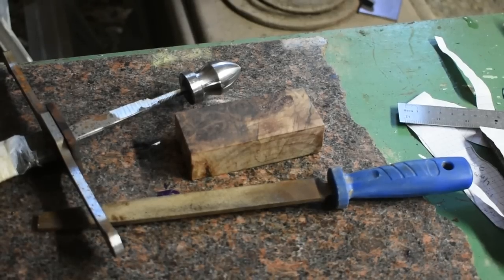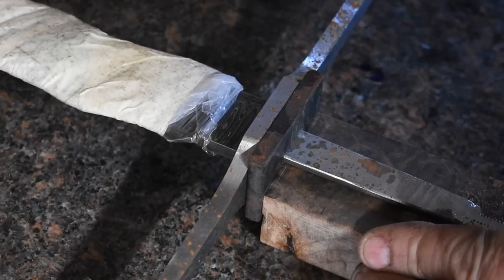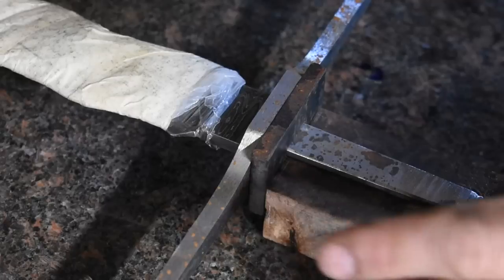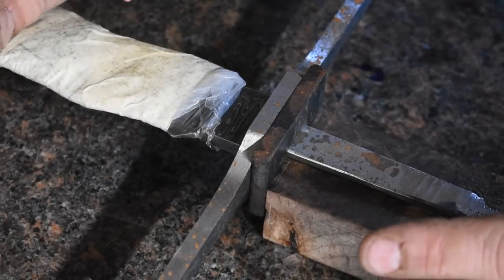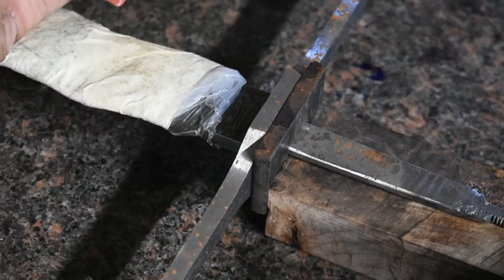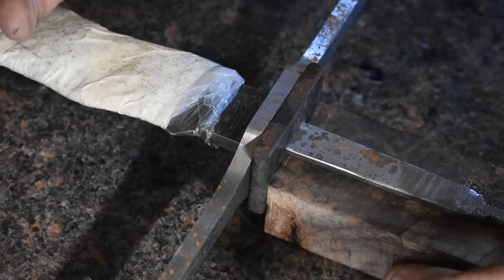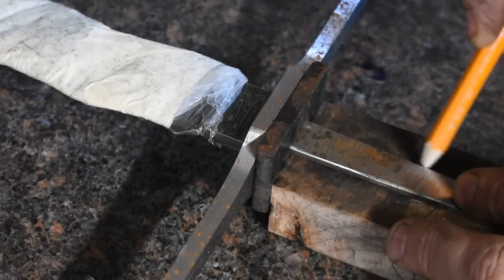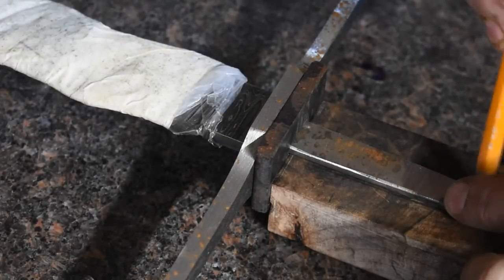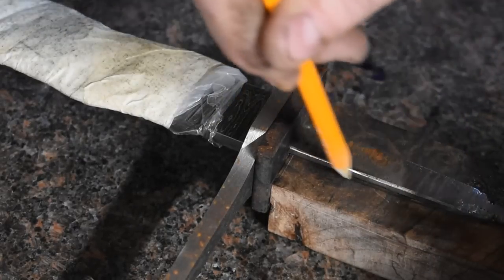Okay, we're going to line this up the best we can. Make sure it's good and straight. I got a 1-2-3 block up here and under the blade portion holding it in place. Make sure everything lines up with our hole. Now I'm going to go ahead and sketch around right here, and then we'll get our handle broached out. Then we've already got a 1/4-inch hole through there, so the all thread will go through with no problem down there. Not too worried about that.